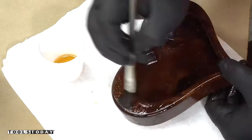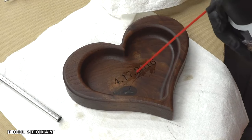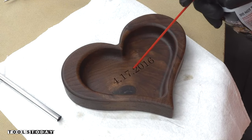Formby's tung oil is a great finish — super easy to apply and it always looks really nice. We can get it all buffed off and I really love the matte finish that it always gives these pieces. One little tip: you can use some compressed air to blow out the finish from the engraved areas. That way you get a nice same luster throughout the whole piece.